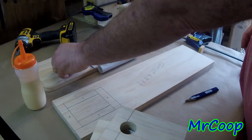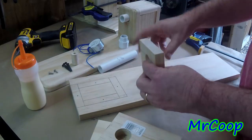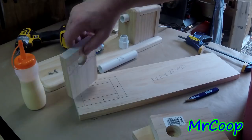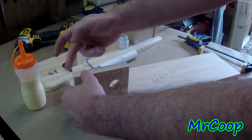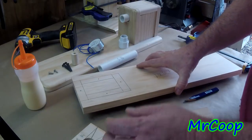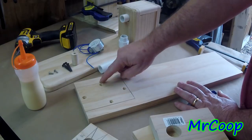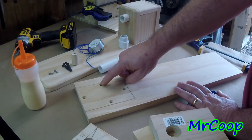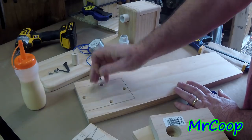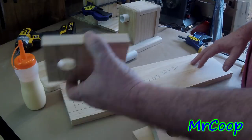First you want to take your wood, basically lay it on your board, draw a line — just like I have it marked out here. Then what you'll want to do is turn it over and drill all those holes and countersink them, so that when you screw from the bottom it will set down in and won't have anything bulging up on your table.